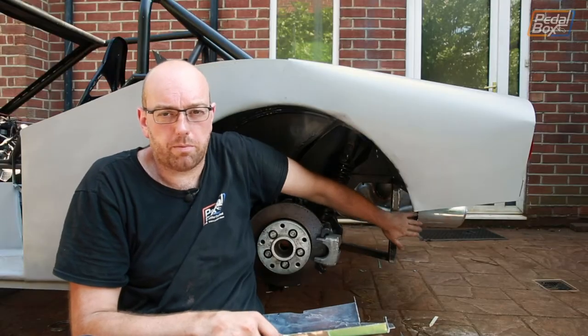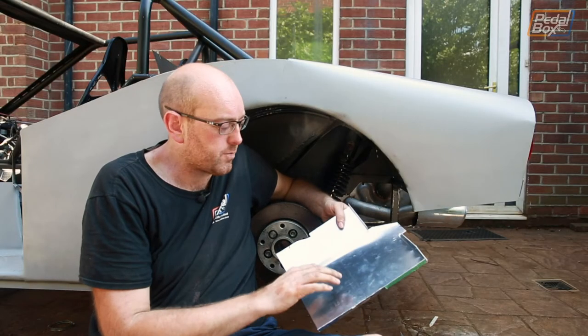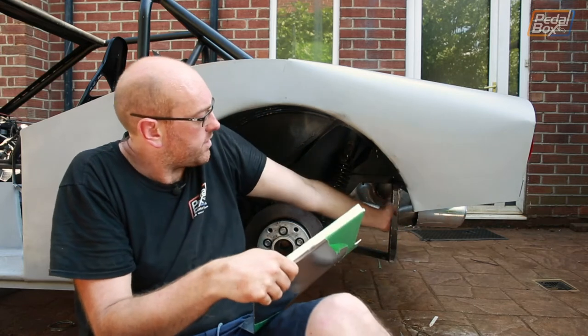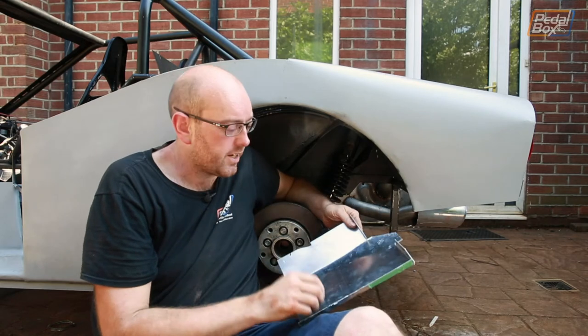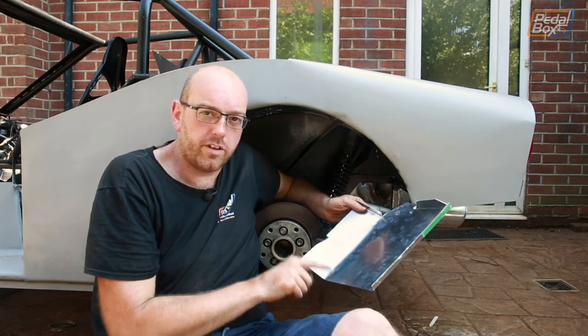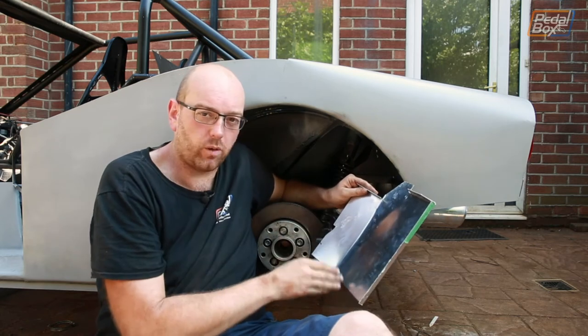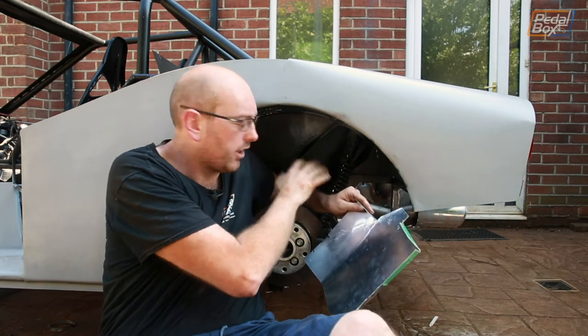Now, since Chris welded in the upright, I can now put in the last panel, and I've spent about an hour or so shaping this and putting the various flanges on it to sit up against the inside and underside of the chassis. Unfortunately, the bottom corner is proving to be more difficult because I can't hold this in place well enough and get the fold at the same time exactly like it should be for the car.